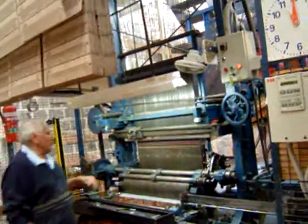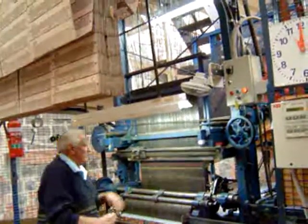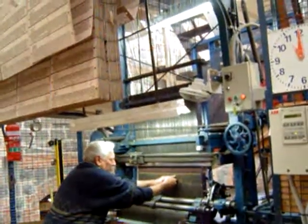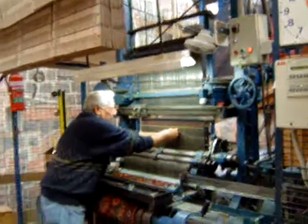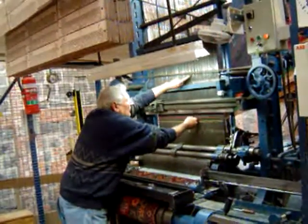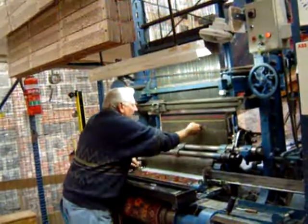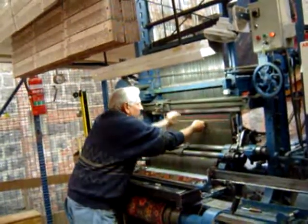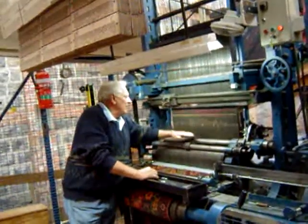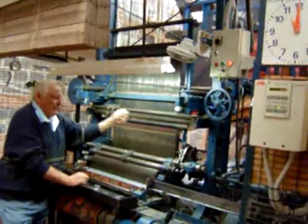Wouldn't sell very well. So what we have to do, of course, is bring these other colours up to that top frame so our grippers can reach. In other words, folks, if I want that brownie or biscuity colour, the one there on the very bottom, now we want him in the pattern, then he's got to come all the way up to there amongst the black. Now look how far up he came, right up to there. But if I want that red or cherry colour, then he only has to come to there. That's not so very far at all. In other words, the lower down the colour is here, the higher up it has to come to take his place in that top frame so our grippers can reach.